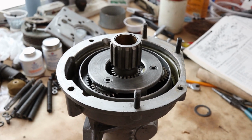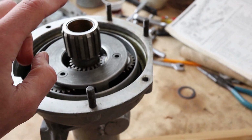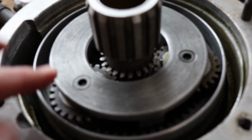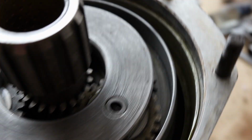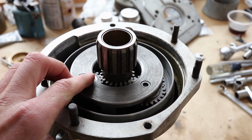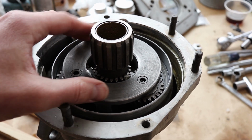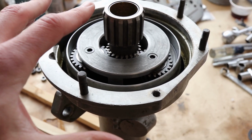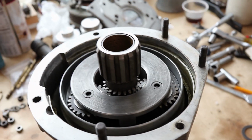Right, so that's kind of it for what we can do today on the Overdrive, but I'm just going to show a couple other things that are kind of important here. The first is that while you can put this gear in pretty much any position, there are little dots on here that have to be lined up in the right spot on each of these gears. See if we can get that in the frame. The idea is to have all of the little dots on the planet gears go through the center of the sun gear. So you have to kind of fiddle with these planet gears to get them in the right position. We've got that set here, and once you get it set, you don't want to let this come out because it is kind of a pain in the rear, but probably not the biggest pain in the rear on this whole project.